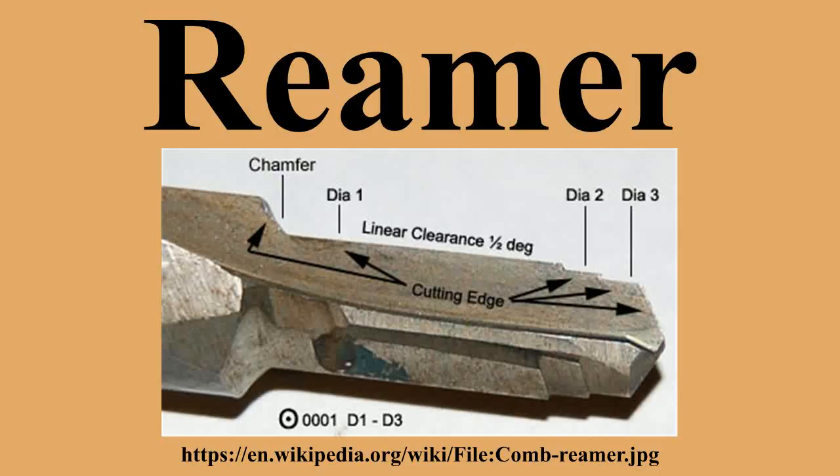A tapered reamer may be used for cleaning burrs from a drilled hole or to enlarge a hole. The body of the tool tapers to a point. This type of reamer typically has a body up to one half inch in diameter, with a rod cross piece at the large end acting to form a handle. It is especially useful for working softer metals such as aluminum, copper, and mild steel. Another name for it is maintenance reamer, referring to its use in the miscellaneous deburring and enlarging tasks often found in MRO work. A similar tool can be seen on select Swiss Army knives, such as the electrician model, to be used on conduit.